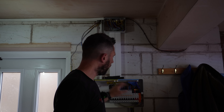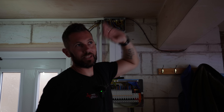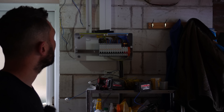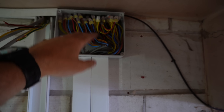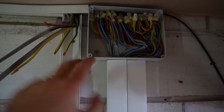We've got the majority of the house wired back into the board and extended. I've tried to loop it back so all my connections are at the top. Yes, if you use a consumer unit extender kit it could be neater, but I've even seen those be a right pain. I need to fire seal all the top to make sure there's no transfer of fire. The cables are dressed in at the bottom - there's room to manoeuvre wherever needed. The next job is to extend the water and gas bonding and get this lot sorted.